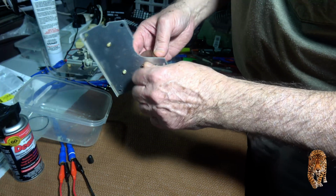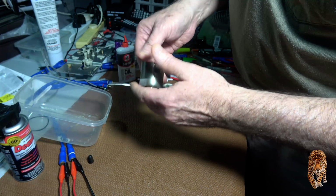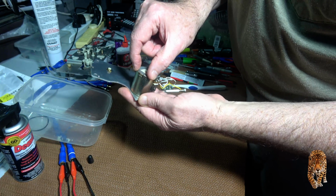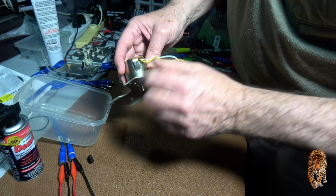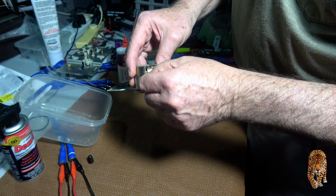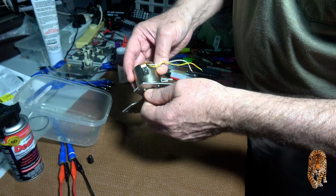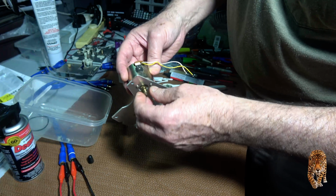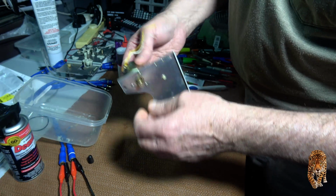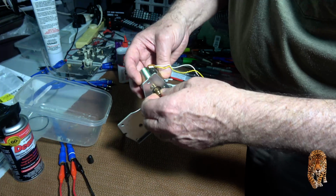It looks to be a DC motor, but under some sort of, I don't know, maybe pulse width control with the IC inside there. There's a big long, about a 9-pin single inline IC. And this Darlington is in series with the actual motor, which drives the motor, not off or on, but linearly. So yeah, it's a bit more complicated. So it should be all right. If not, we'll find out later on.